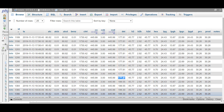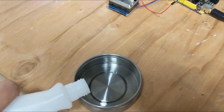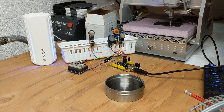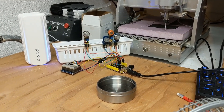The second thing I noticed was that the MQ sensor readings did not move around at all during the laser cutting. This was pretty concerning to me, so I decided to pour some chemicals — such as acetone and ether — into containers and waft them in the general direction of the sensors. The sensors did move around a little bit, but I wasn't able to get any usable data as they were reading high one second and normal the next.